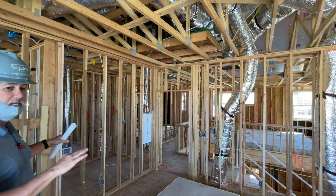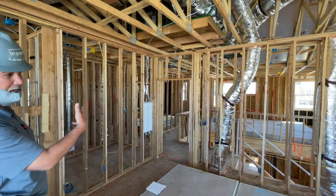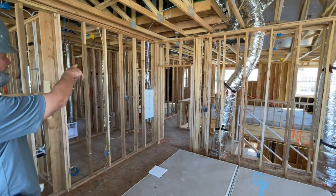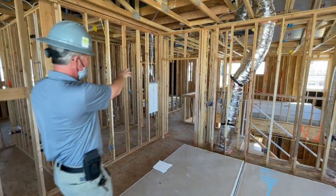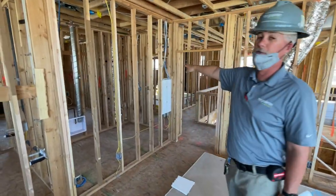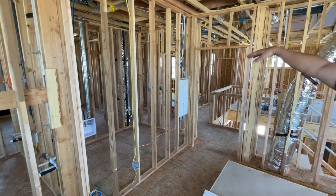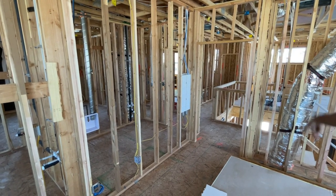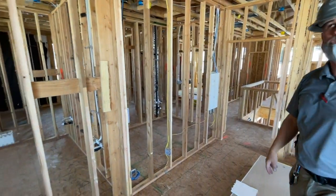And then blend it in to work, especially with that big open air coming in through the front door. You'd normally have a thermostat right outside. In the model, it's actually right outside the door of the entry, but we put it a little further down the hallway so that the people in the bedrooms would be a little more comfortable. So one thermostat up here in the hall, one thermostat downstairs. That's what I was going to ask you next. Two separate thermostats.